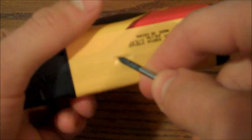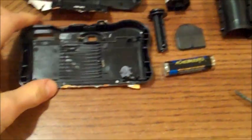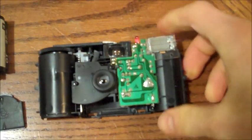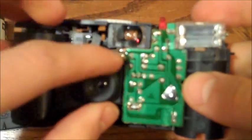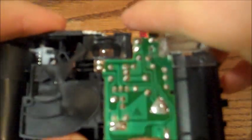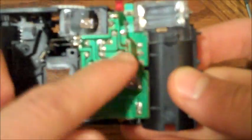Using a sharp thing like a screwdriver or scissors, cut along the paper where the groove is and pry it open, and I'll show you what it looks like inside. When you take apart your camera, as you can see I've got the shell here, the film, your battery — which in this case is a double A which I took out — a few extra parts, and the thing we care about is this here. Before touching anything, make sure you touch something metal to these prongs, which will take all the electricity out of your camera so you won't get shocked. I unscrewed a few screws here so I can simply take the little lens off. All we care about is this little circuit board here, which is connected to the flash and is pretty much all the electrical components, so I'm going to work on getting that out and show you how to modify it for your taser glove.